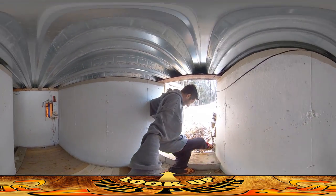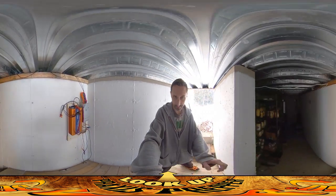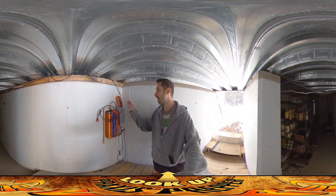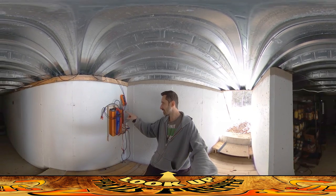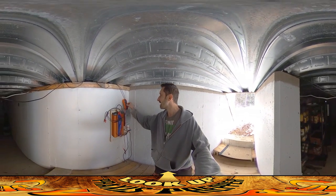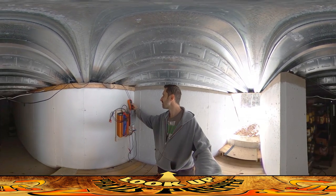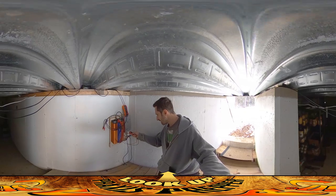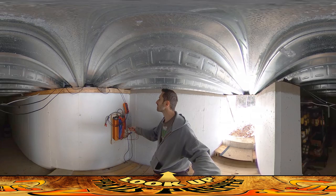Today's a little unhinged. This morning I thought I was going to come out here and look at all the beautiful power coming in, but it was kind of a bumpy ride. It's coming in now. I've got the multimeter on here — the lights on this guy are going, and it's now flashing that the batteries are full. I'm going to turn this multimeter on, put it to DC mode, because it defaults to AC mode, and check the batteries.